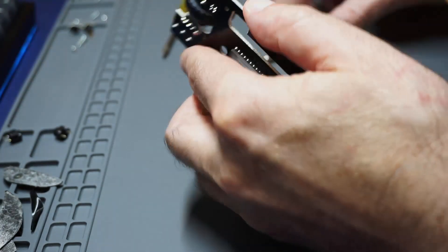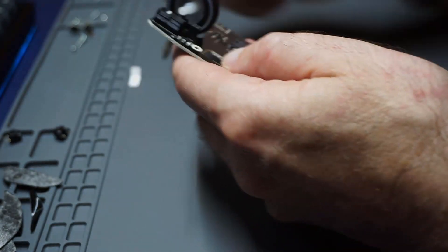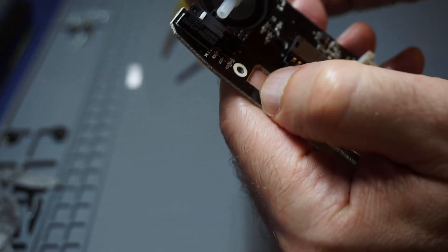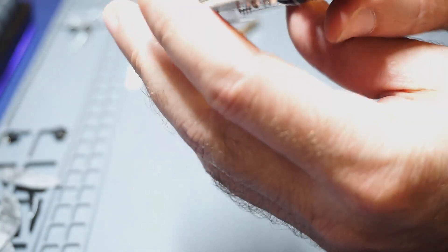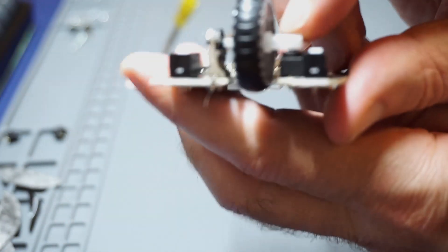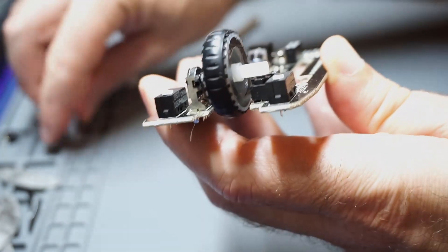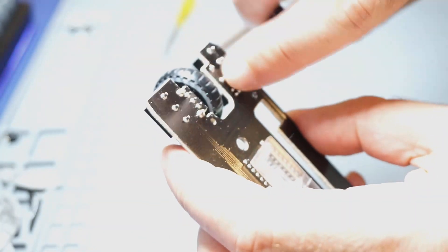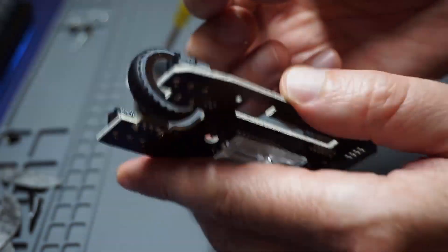Here was my temporary repair that lasted for about a week. Take that out. What's going on is there is a little button in here, right at the front, that this piece presses against — and that little button goes bad. So that's what we're going to replace with one of these new switches. We're just going to unsolder these two pins here and then put the new switch in instead.